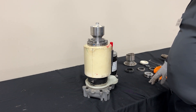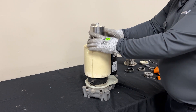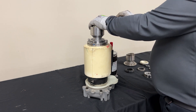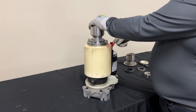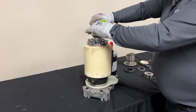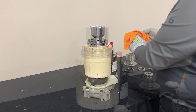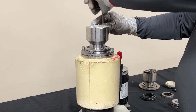After diagnosing a bad bearing, you are going to want to remove your breaker. To do that, we need to remove the top nut so that the breaker can be removed separately from the auger. We will need to grab our crescent wrench. A tip: if you just push it, what's going to happen is it's going to grab the gear motor and start turning it. So you really have to whack it — that jarring action is going to allow this nut to come free.